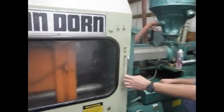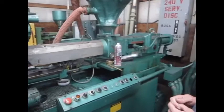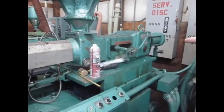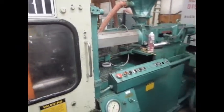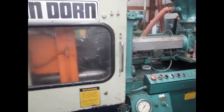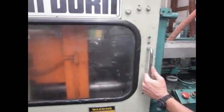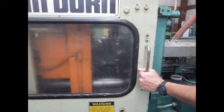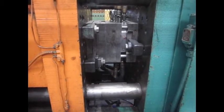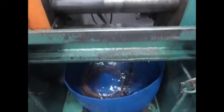I'm Gary, and I'm running the MotorMate machine as we speak. You're seeing this thing moving back and forth — it's injecting molten plastic into the die to form the MotorMate part. Hot nylon, hot plastic, and a lot of pressure. That's getting ready to open. And it's getting cooled off in the water.